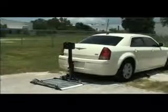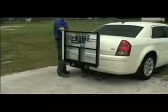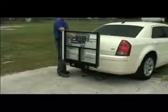An important part of this lift is the patented folding mechanism called the J cam assembly. The cam assembly consists of one J cam held on by a shoulder bolt, two extension springs, and a stainless steel roller. The cam assembly is what allows the platform to sense weight and fold accordingly. When raising the lift, it is important to continue operation until you hear a ratcheting sound from the motor box, which is a clutch. This sound is normal and should be heard. Failure to raise the lift completely can cause damage to the lift.